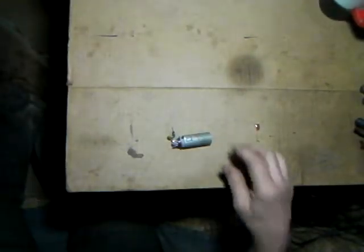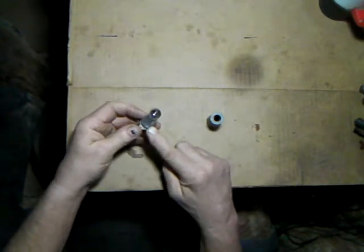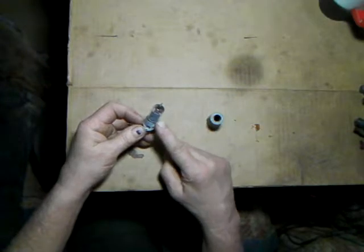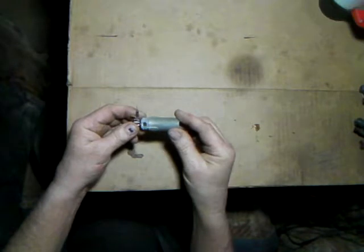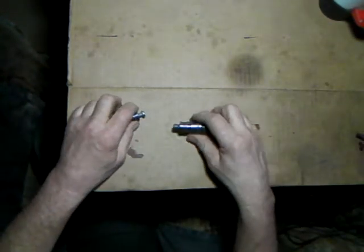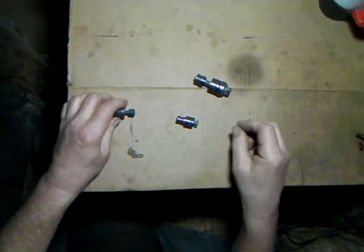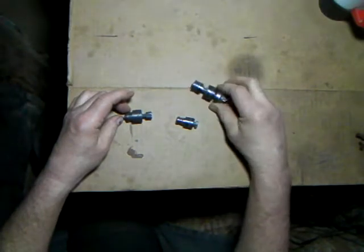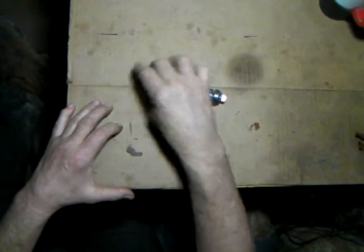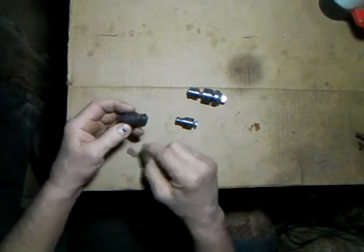Other stuff to keep your eye out for is tube sockets with shields. If you use one of those Motorola boards it'll have several of these. They're important for your mixer stage, RF stage, and IF stages, and buying them brand new off eBay can cost quite a bit. For tools, I prefer a Greenlee punch to punch my holes for tube sockets - the half-inch, five-eighths, and three-quarter sizes are the most common. You drill a starting hole, assemble the punch, crank it with a wrench, and it pops a nice clean sharp-edged hole.